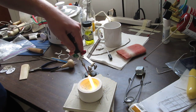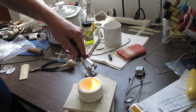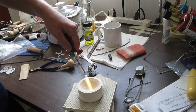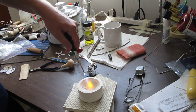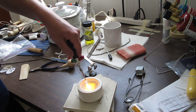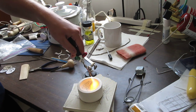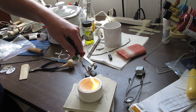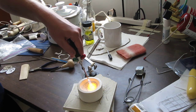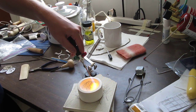So now it is going beyond the bubble phase. If you have done soldering before you'll recognize this level — you want it to kind of turn into a black glassy phase. The flame keeps turning green; that is the burning of the flux happening. I am starting to reach that glassy phase now, and I might add a little bit more flux in here.